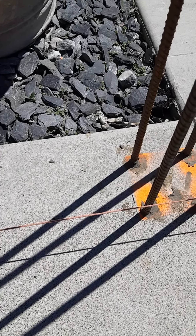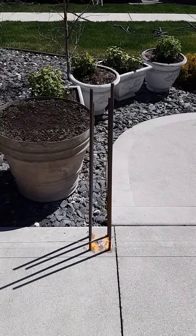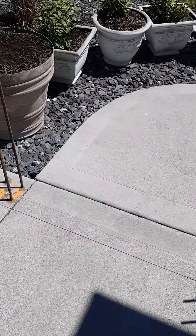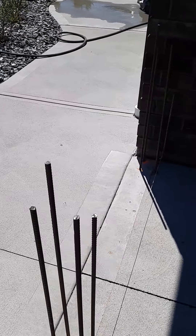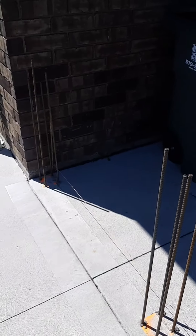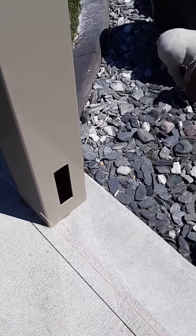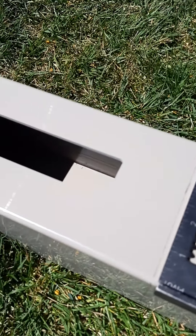From this section you see here, there's a gate going here, so we're gonna run from this post being installed to the post here. We'll level across the tops of the posts because there's still a little bit of slope on this concrete, and then this short section back to the wall will be run level also. We'll run the two gate posts level across the tops, and then the third post at the wall level across the top. We're gonna maintain about a two-inch bottom space, so we'll go ahead and mark our post from the hole two inches down.